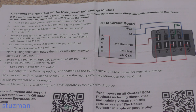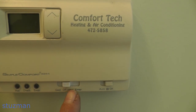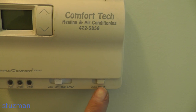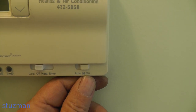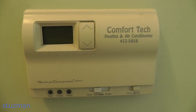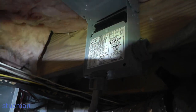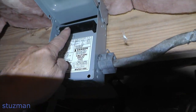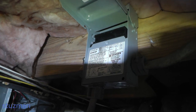Let's go ahead and get this thing installed. Before you take the motor out, I should point out that I have the compressor and condenser fan stopped because I have it in the off position. The fan is in the own position so just the fan will run. Now let's go down and get this thing installed. What I showed you on the thermostat was for the 24-volt control — that is not going to take care of the line voltage. You'll have a unit similar to this with a pull handle — it's pulled out. Make sure your power is off before you start taking this unit out.